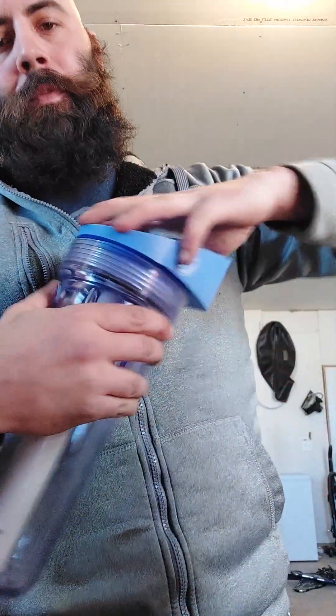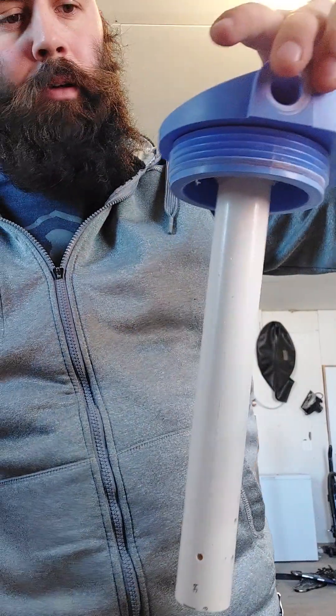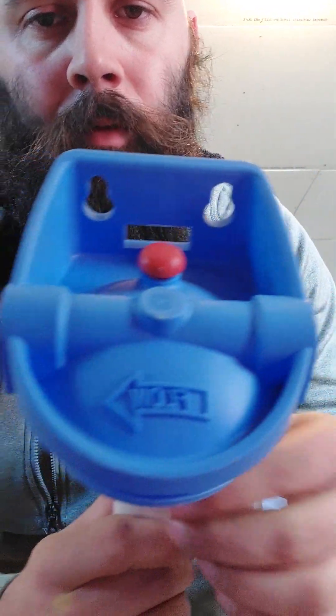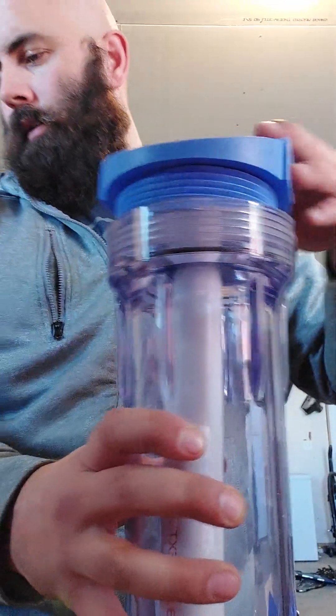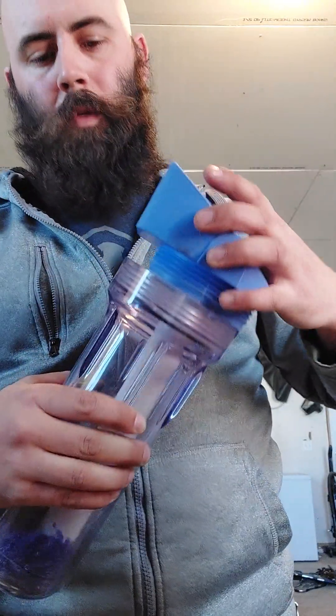I'd recommend more than just a water bubbler — the next one would be a desiccant filter, which we can talk about later. If you want something fancier, I'm using a filter that was originally made for well water. I run it backwards: the biogas comes in through the tube and has to bubble out to exit. You fill the housing with water. To make one, you take a one-inch PVC pipe and seal it up around the top — easy peasy. I'll put a link in the description.